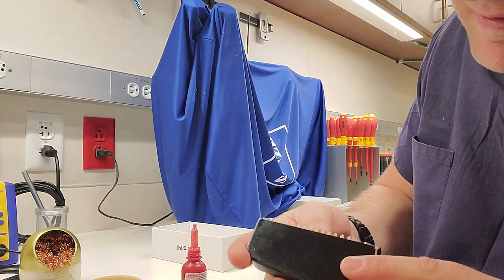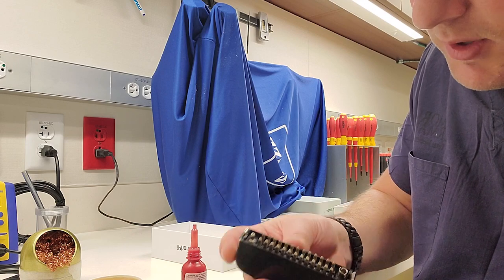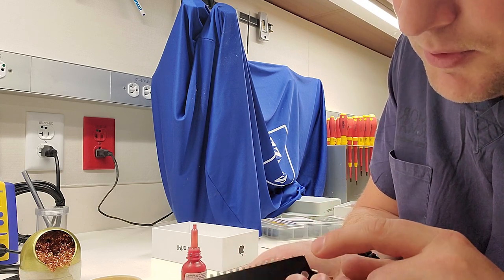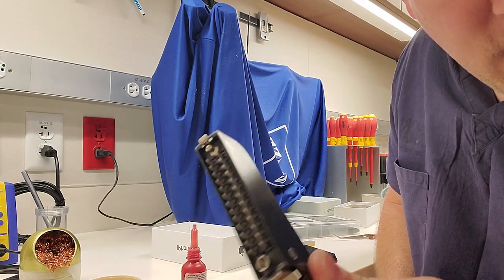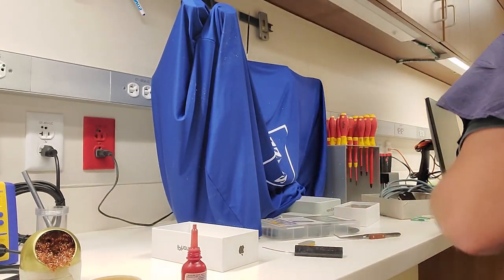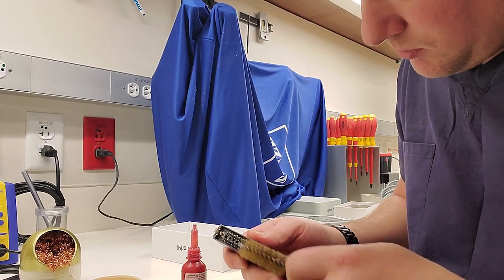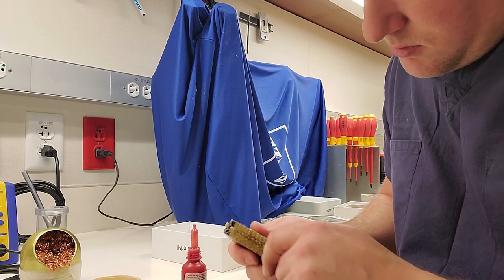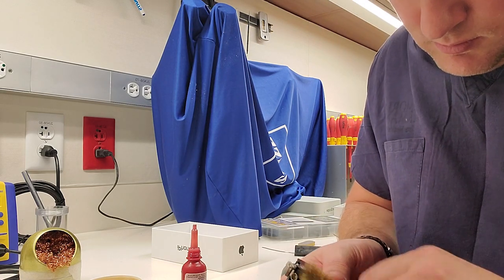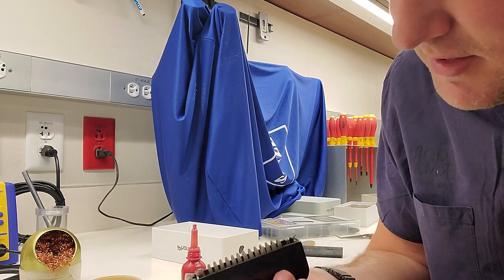I've tested it for tension and the spring catch is still there — everything looks like it's still working fine. The next thing to do is clean these pins. The pins almost always have a little bit of corrosion on them, so I'm going to get a brass brush and give them a good brushing right before putting this back into service. Just clean them up a little bit — not too aggressive. That brings the connector back to a nice shiny brand-new look. Look at those pins — that looks fantastic.